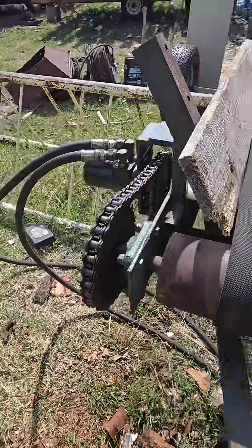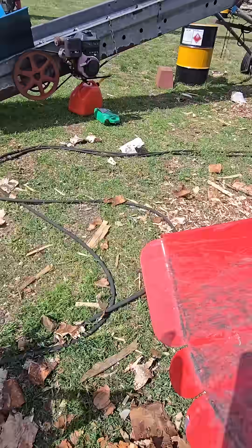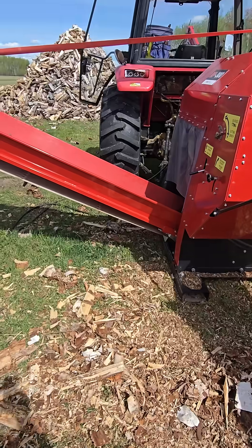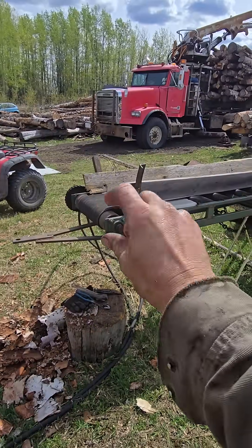And so then I take and put my hoses onto this other tractor — same scenario. What the heck? Both ways it just pressures up the line, won't work, won't function. It only just rotates just a tiny bit and then nothing.